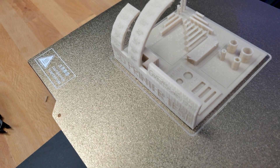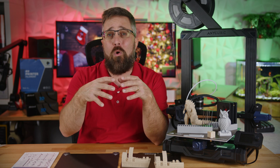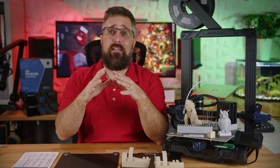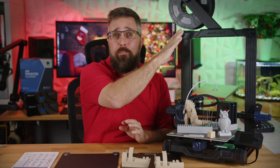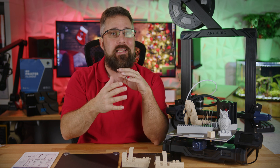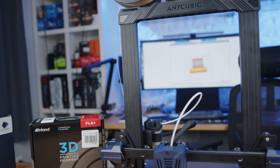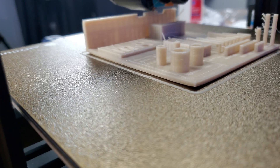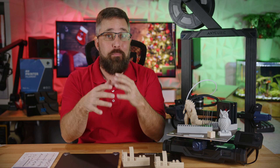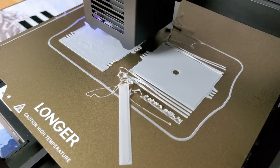I increased the retraction and retraction speed, adjusted the temp slightly, slowed down the outer wall speeds while increasing the inner wall and infill speeds, and loosened the bed rollers to reduce compression along the Y-axis. I also decided to switch from the PLA that came with my Anycubic printer, because while I've had no issues with that material on my Mega S, I noticed it had some adhesion problems on the PEI bed. I tried some Inland PLA Plus from Micro Center, but unfortunately encountered the same adhesion problems. I'm now convinced it's the gold PEI plate — it looks like the build plate is the same one used on a longer printer I reviewed last month, which had similar adhesion issues with certain filaments.